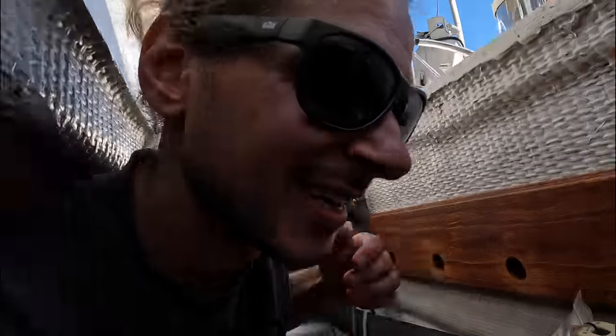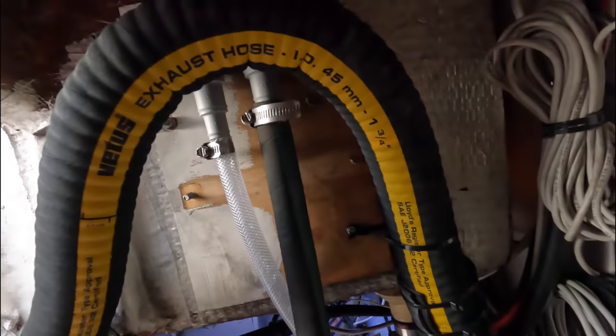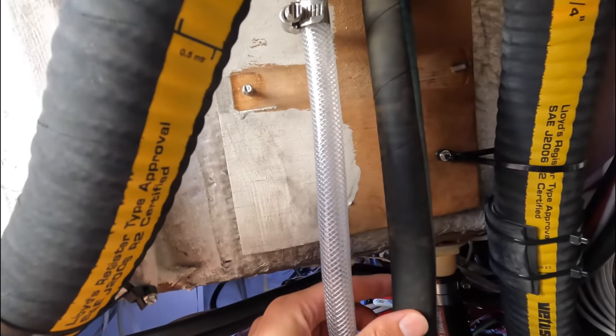All right. Success. So the last thing to do is I want to watch, because funny enough, we have this vinyl tubing that is clear temporarily on the exhaust. We'll be able to watch the siphon break with that anti-siphon valve. It should just drain the entire clear tube because it's letting air in at the top of that loop through that valve. So Katie's going to come out here and she's going to shut the engine off and I'm going to be watching it. All right, you ready, honey? Okay, anytime.